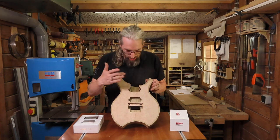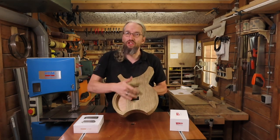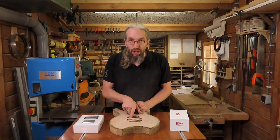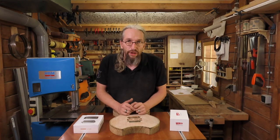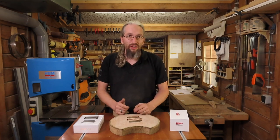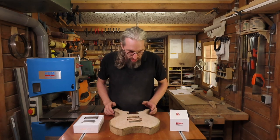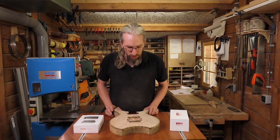All the cavities are done — I've got my pickup cavities and of course the cavity for the bridge and the springs in the back, so the routing should be done for now. My apologies if I didn't include footage of me using the quarter-inch bit to tighten up the corners of the pickup cavities — my memory card was full so while I thought I was recording it didn't record anything. It's a very easy job: just make sure the shaft runs along your template and push your quarter-inch bit into the corners so they are nice and tight and even. If you'd like me to show you, please leave a comment below and I'll do a separate video on routing techniques.